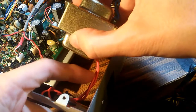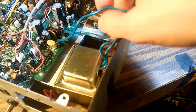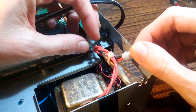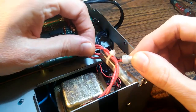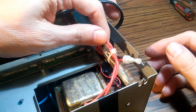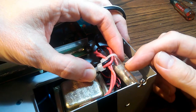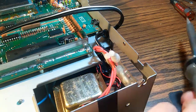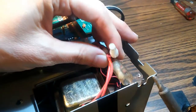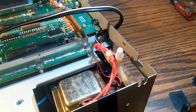These are the inputs: this is to the primary coil — the input — and this is the secondary after it's been stepped down to 14 volts. The power supply primary lines are spliced into the AC power line — that's the red one spliced into the black ones. In addition, we've got a 1.8 megaohm resistor connecting one of the AC lines to the chassis, soldered to a little post right there. We'll get that off to give us a little more room to work, and that makes it easier to move the power supply around.